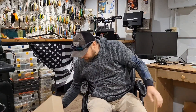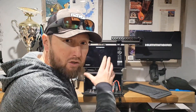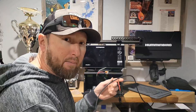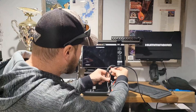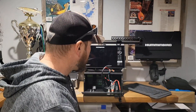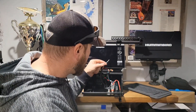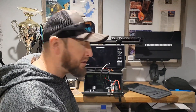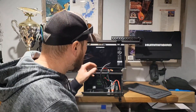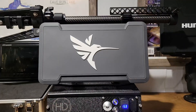One thing I want to talk about before we get this unit powered on is the power cable — it is enormous. The power cable almost weighs as much as the unit, it's very thick. You can see my Solix cable right here is the average size that the Helix was as well. These two power cables together — it's twice the size. It also has three wires inside of it. It has a shield wire that is going to be grounded to your boat, your ground under your chassis, wherever your boat is grounded to. In this situation, inside this HD Innovations shuttle, we're going to route this shield wire into our ground terminal as well, so it's grounded to the battery.